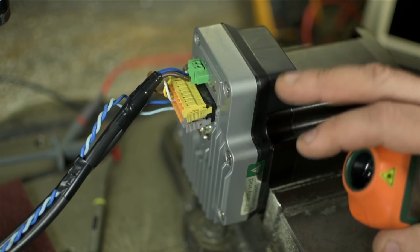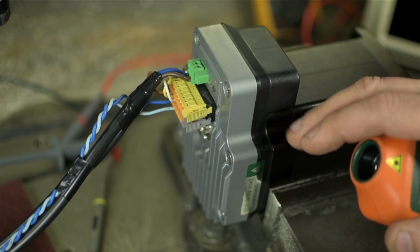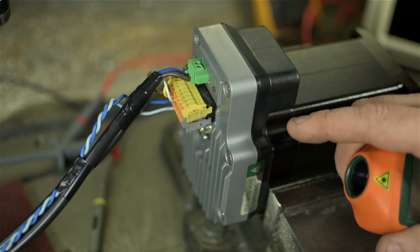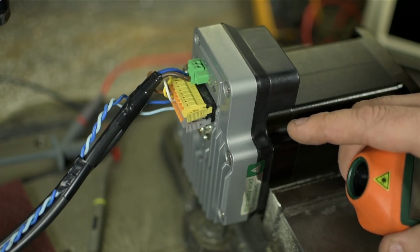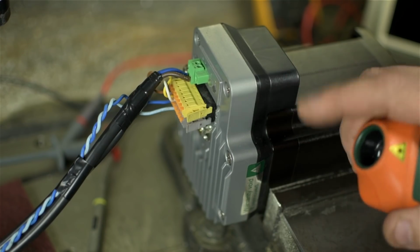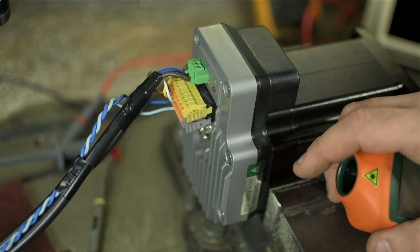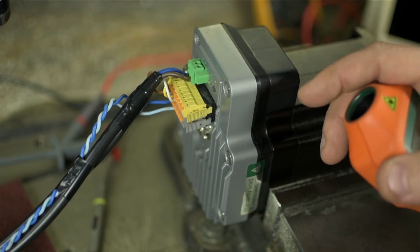I've still got to work out the software side of it, but in theory, that lets me monitor and compensate for changes in motor speed. Potentially allows for my G-code to wait for the spindle to get up to speed before it comes in with the, you know, spinning end mill. And open some doors for constant surface speed machining. All in all, I'm quite excited.